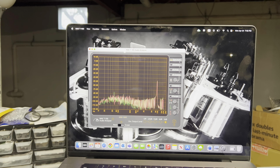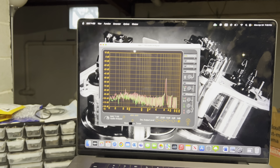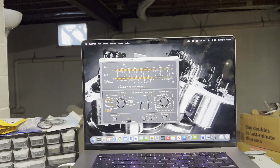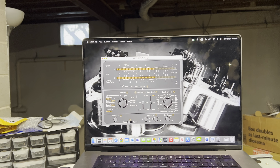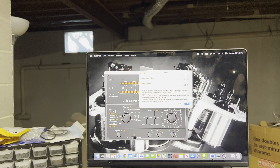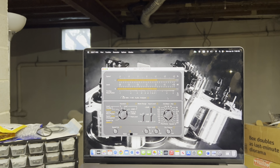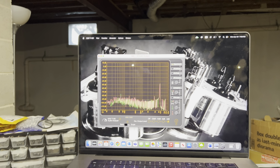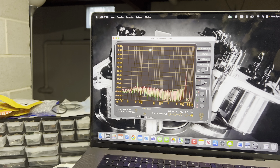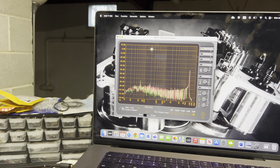I'm going like -10 or -8. I probably didn't adjust levels yet because I didn't tune up the computer sensitivity and input sensitivity. It should be about minus 15. So you see it goes up to 10 kHz at the same level - 12, 14, 15 - and goes down with no change in level.